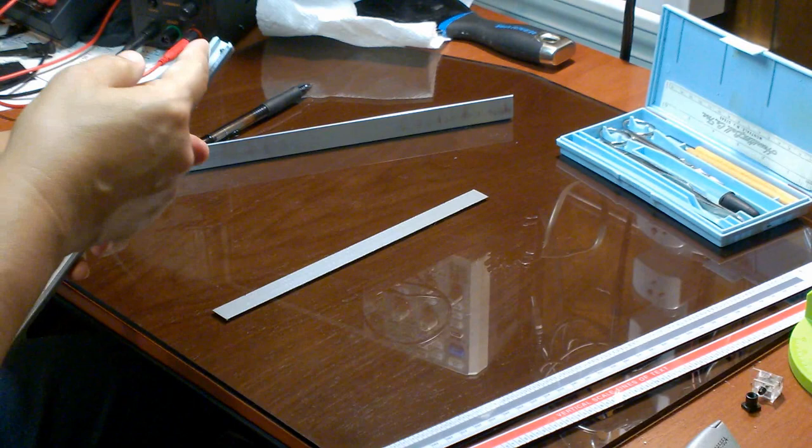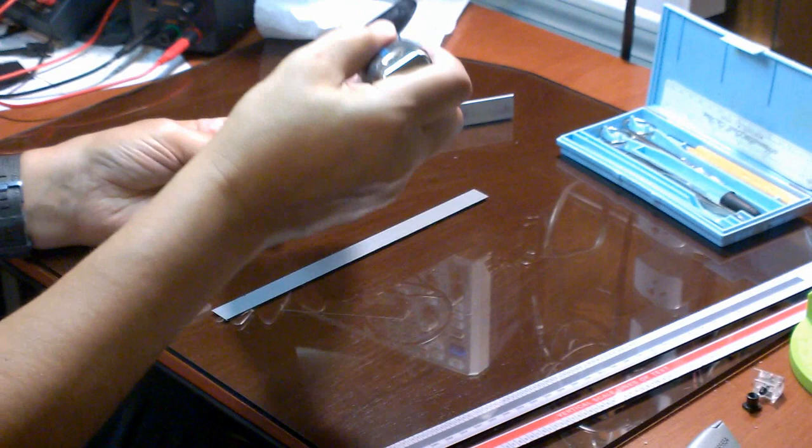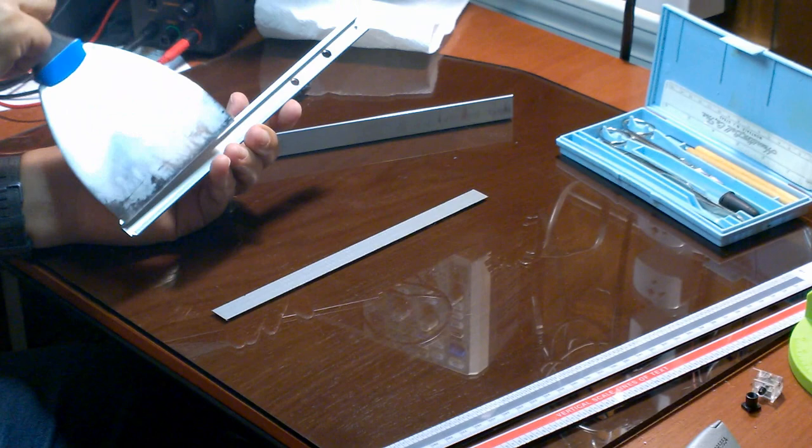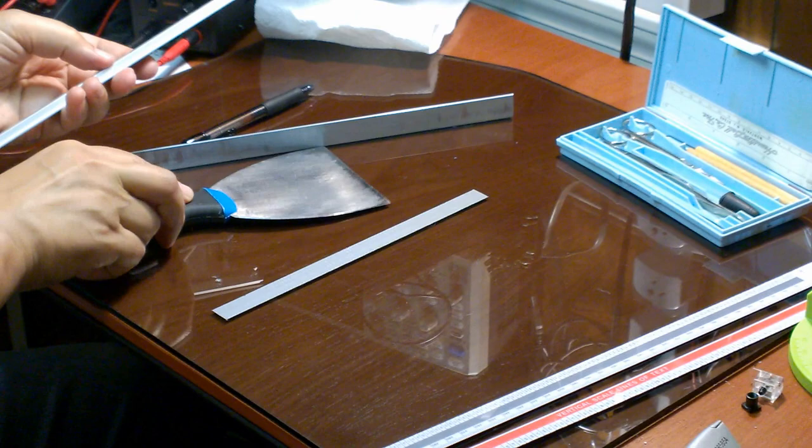And used the remaining 15 millimeter wide strip to fold around the miter gauge rail. I started on the underside of the rail and placed the tape precisely aligned with the vertical edge and smoothed it out with the putty knife. Then I worked my way over the corner onto the bottom edge of the rail, smoothing out all the bubbles. Then onto the side and top surfaces. I tried to cut the tape precisely so it wouldn't protrude above the top surface of the rail.